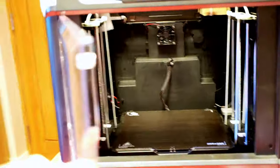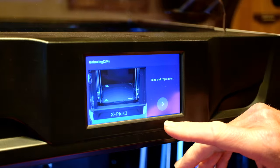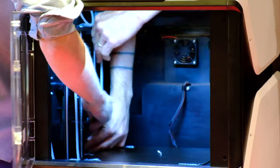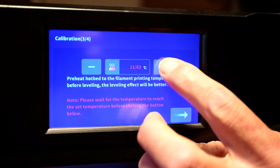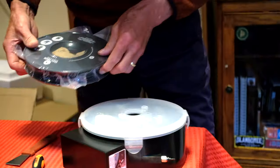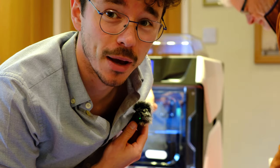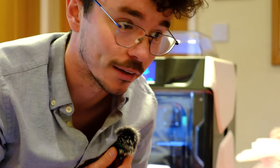It's just plug and play. We're on. A lot of this is going to be automated — it's just cycling through a list of commands. Remove the zip ties. Remove four screws on the fixed hotbed platform. It's ascending. The filament temperature is 220. We just wait until it gets to the set temperature for the specific filament we're using. The whole thing is incredibly intuitive. Even the LED screen, when we forgot to remove a piece of packing foam, it told us which piece we still needed to remove. This thing is very clever — really straightforward. You could do this with no experience.